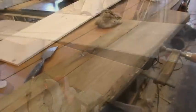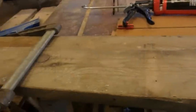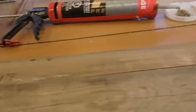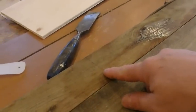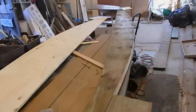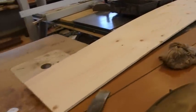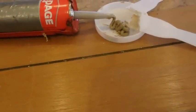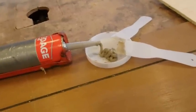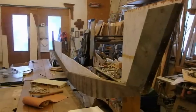I've clamped a big two-by-six — fairly straight — onto this frame to straighten it out. The plywood will come to here on the next piece. Now it's just time to apply the adhesive, which has spit out quite a lot, but I'm not going to waste that — it's very easy to just scoop it up with a spatula. Here's the first frame put together.